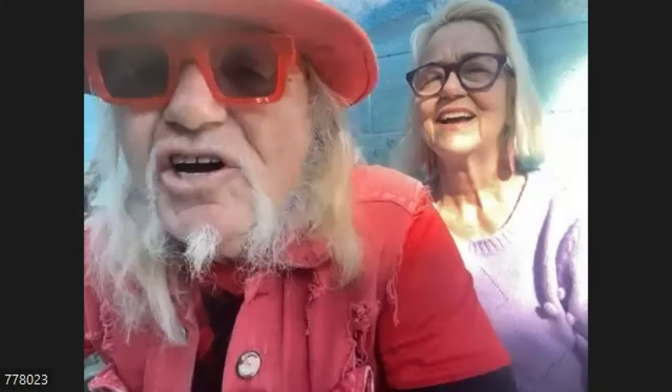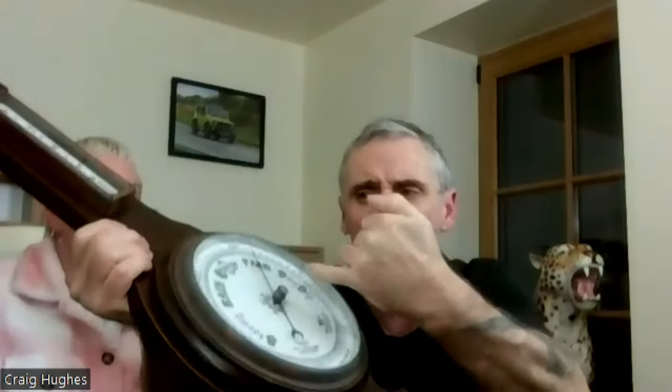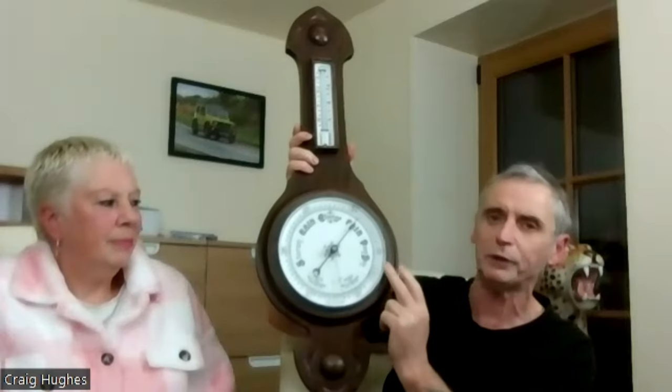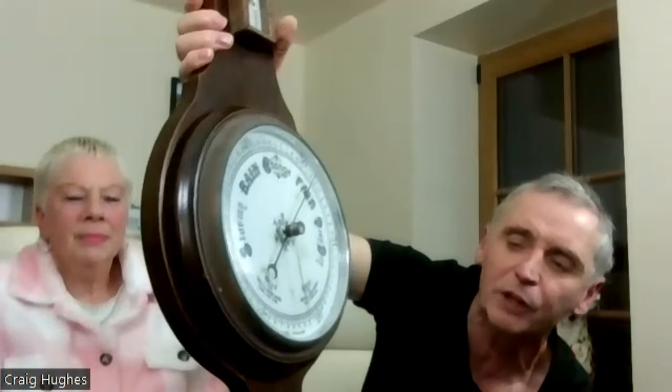It's got brass and it's kind of arts and crafts, isn't it? There's little cutouts - it's got that Macintosh look to it. As Nicky's just pointed out, if you can see inside the glass, the rim is shiny. A lot of people would have thought that's chrome, but they didn't do chroming back then - that would be nickel plate. So you've got a brass ring around there, nickel plated. But over the years, that's been hanging on somebody's wall and they've been polishing it - it's worn through the plate. The bit behind the glass where it's not been polished still has the nickel plate on it.